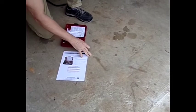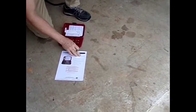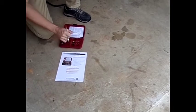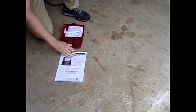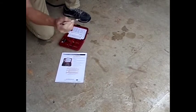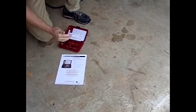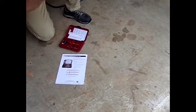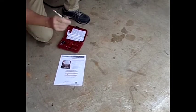As we can see, hear, and feel, this tip is harder than the concrete, therefore it made a scratch. We're going to continue working our way down to number eight — same thing, same results. Then down to number seven — still making scratches. Number six — still scratching.